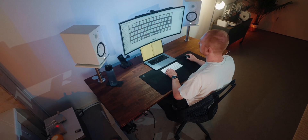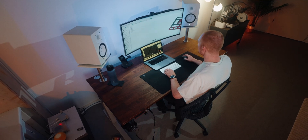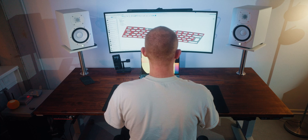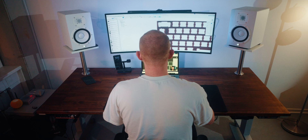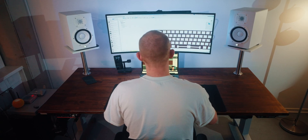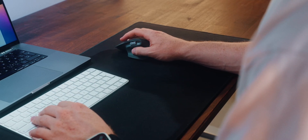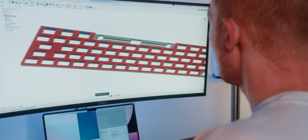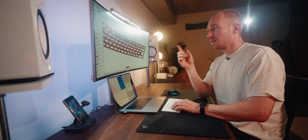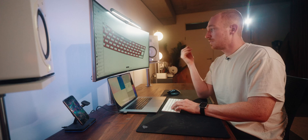The next thing is to download my layout, import it into Fusion 360, and actually design the keyboard plate and case. I made two parts for the main keyboard plate — both 1.5 millimeters thick. The first is the actual mounting depth for the key switch, and then I needed 1.5 millimeters extra to give the 3D print enough strength to hold. Right now I'm clicking every keycap hole and giving it 1 millimeter more space for the keycaps to actually fit in, on both sides. It's really annoying but it's important.